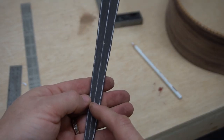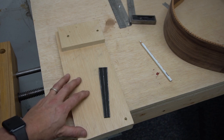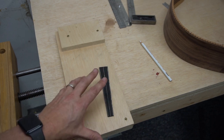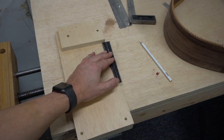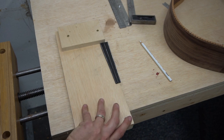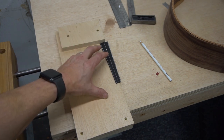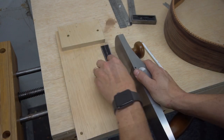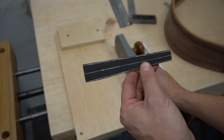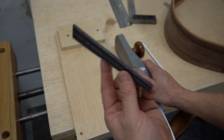I'm going to trim this off a little bit — it's a little narrow down here and I don't need quite that much height. To trim this up I'm going to use a shooting board. Now to call this a shooting board is a little bit of an insult to shooting boards everywhere — it's simply meant to provide a little end I can plane up against, with a bench hook. We can make a proper shooting board later. You could also take care of this with a belt sander or disc sander — there are a number of ways. I'm just going to shoot it with a plane.